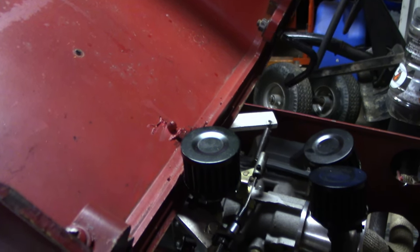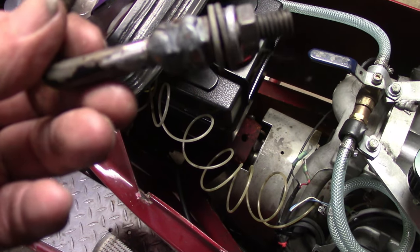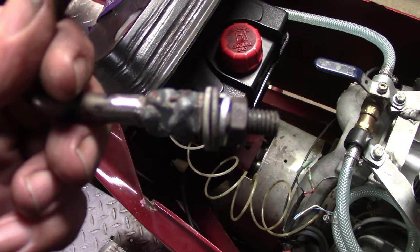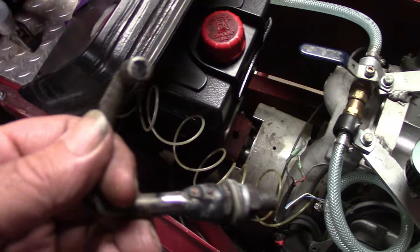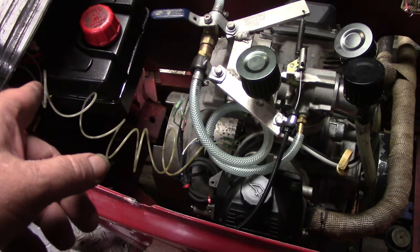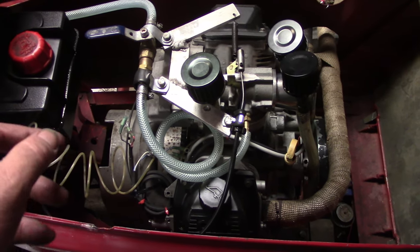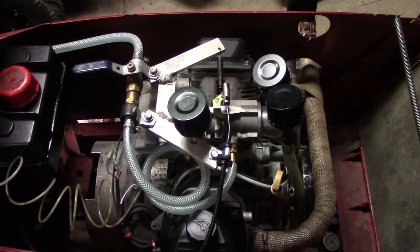Alright y'all, we got that all welded up — not the prettiest weld, but it is welded up. We used the nut as a coupler, welded it to the nut that was already on there and welded around the other side. It should be good and strong. We're going to put off installing it until we pull the engine to do the governor change. So now we need to start it up. I got all the excess fuel out of it — we've got to run the bowl dry, then put some WD-40 in the tank and pump it through to fog the block. The engine will be ready to be winterized.